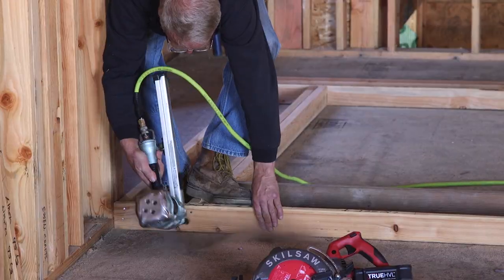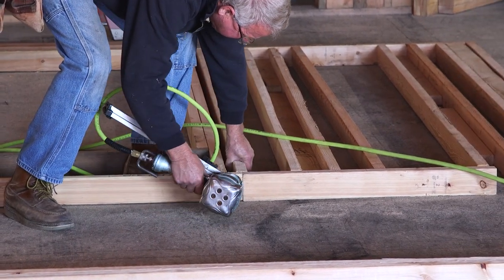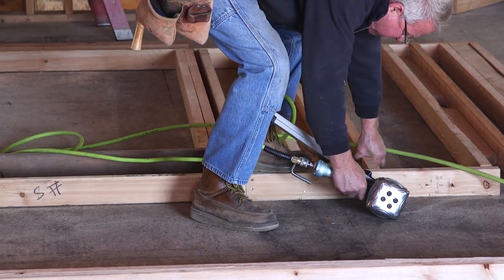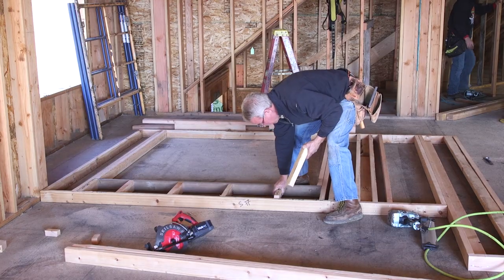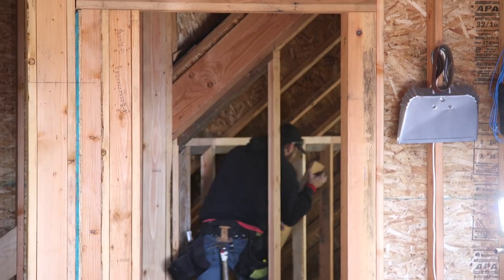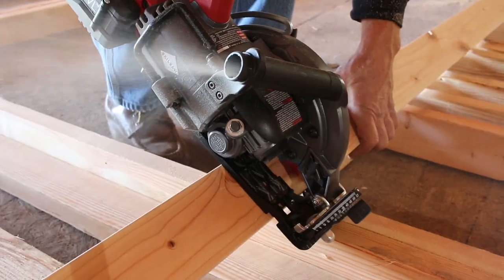After that it's the same type of wall assembly that you saw everywhere else. Follow the details on the plates, make sure you are as accurate in the stud placement and in the nailing as you can be, and then stand the walls up, brace them in place, and move on to the next. One thing that's different on the second floor is that the height of these walls varies a lot. There are different ceiling heights in different rooms and different spaces, so I'm having to keep track of that quite a bit.